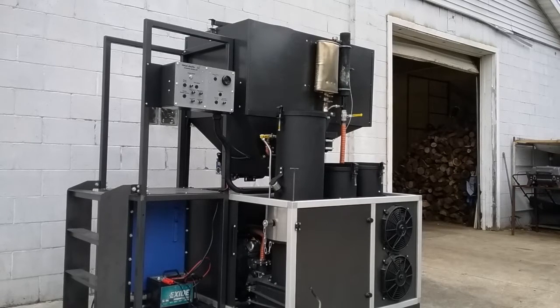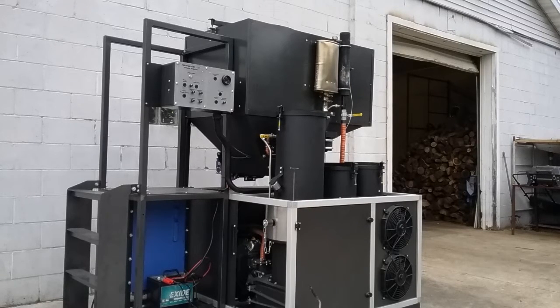This is a very powerful machine in a very small package. The large feed hopper holds one cubic yard of fuel, giving you about a 10-hour run time. The gasifier unit is our Flex R1 gasifier system with 24-hour or longer servicing intervals. It's very easy to service — the ash cleanout and the cyclone filter trap cleanout are very easy to access.